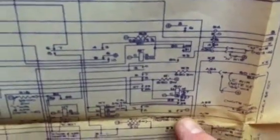Now the ring trip didn't pull because I fixed it, and you'll notice the busy test, where is the busy test? Right there. Busy test is operating, controlling the ring current. And the problem was this terminal right here on C6.